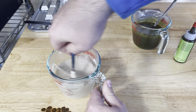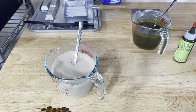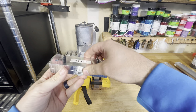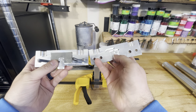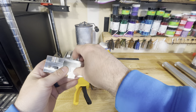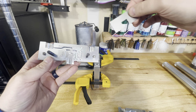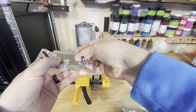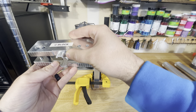This plastic is cooling off really quick. I think I'm going to add just a little bit more of that copper highlight powder, then we'll throw them back in the microwave, get them back up to temp. I'm calling an audible — instead of laminating, we're going to use this Angling AI C block. The C just stands for camo. You have your two colors, one side only comes on this half of the block and the other color on the other half. There's a little divider plate with channels that takes the two colors and splits them into four separate ports, giving you a random camo swirl looking pattern. I actually haven't done the camo pattern on this goby mold yet, so I'm kind of curious as to what it's going to look like.